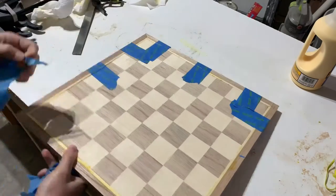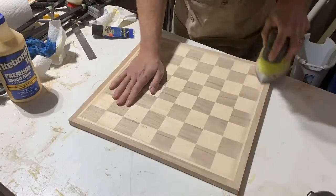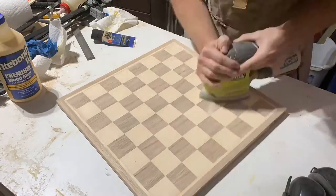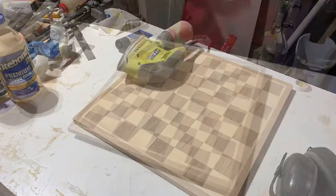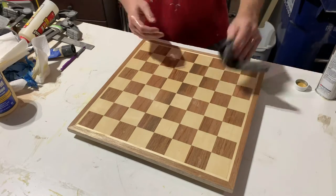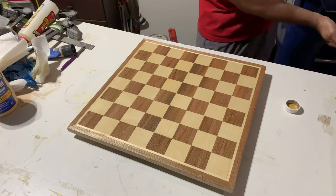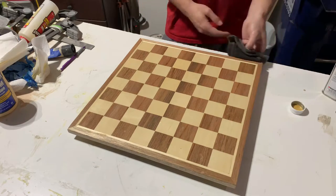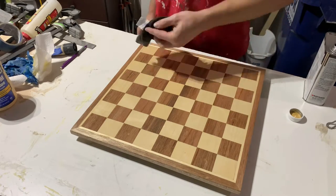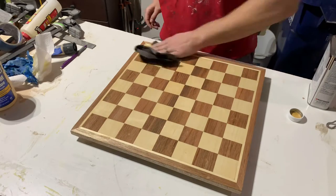Woof, that is a lot of glue squeeze-out — fortunately I have quite a bit of sanding to do yet. After framing I started with 120-grit sandpaper and worked my way all the way up to 400, because I had 400-grit sanding pads, so why not. To finish it I used a natural-colored Danish oil. I've used it once before when I made my coasters, and I like Danish oil so much because it's about as easy as it gets when it comes to applying a finish: wipe it on, let it dry, apply additional coats if you wish, then wipe off any excess after about 15 minutes of dry time.